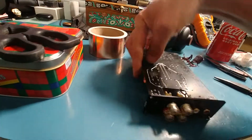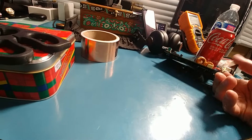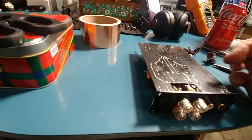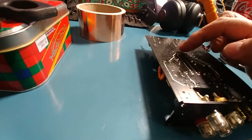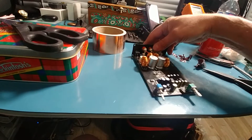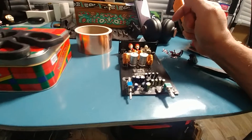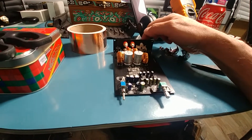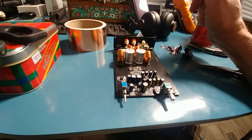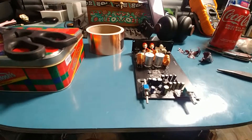As you can see on the back here — what I said about bridging — most of them use the ground plane on the back of the board just for both grounds, but these two grounds here actually go right to the chip and they're separate. So you are physically bridging the amp when you run two channels on this one. You just need a one-into-two input cable. Anyway, let me get this stuff cut up and ready to go and we'll wrap it around.